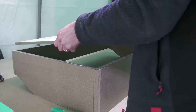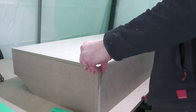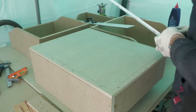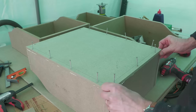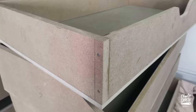Rather than routing a groove and embedding the base in the sides I go for the much simpler approach of screwing the base to the underside of the drawer. This has the advantage that provided the base is made perfectly square — which you can check by measuring its diagonals — when you screw it to the underside of the drawer it trues up the drawer box leaving that perfectly square too. The disadvantage is that you might see the base from the sides when the drawer is open, but with careful painting this won't be obvious, and I think the benefit of this design outweighs this minor drawback.